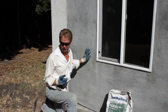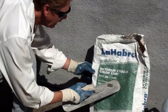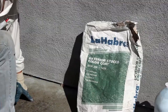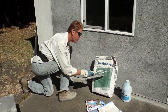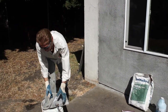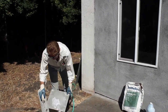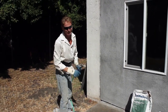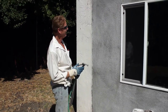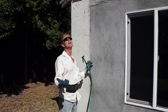I'm going to try to get away with a quarter inch using this 1620. You see right here - 1620 means the grit of the sand. If it says 2030, that means medium. If it says 3030, that means fine. So they have a range, but before I proceed - there's mud in this bucket, mock color coat as we call it. Stucco is another term for it, or cement plaster - all means the same thing.